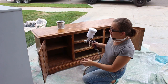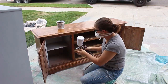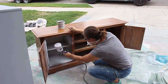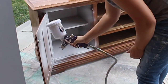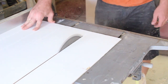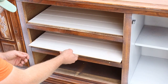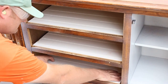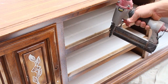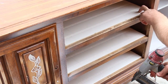I'm doing Fairy Chalk Mother High Bond primer on this first and then I'll be finishing it up with Snowflake. I'm going to staple and secure the front of this deck so it doesn't move around — I can't get the gun in there so I'm just going to staple the front edge. We'll go back with some lightweight filler and make that smooth.